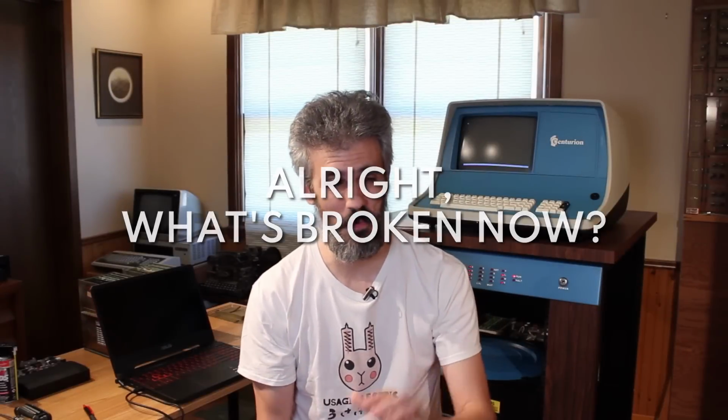So I worked on this way too late into the night last night, and I didn't get anywhere. No matter how I adjusted the sector potentiometer, I could not get it to pass a read test, which is not good. So I got in touch with Ken Romaine, and he started walking me through how to use the test operating system to kind of peek and poke the Hawk drive itself so that we could maybe get an idea of what's going wrong. And well, the long and short of it is that I'm pretty sure we've got a misaligned head, which is not good. That means we're going to need to do a head alignment, which is going to require a bunch of special equipment that I just don't have.